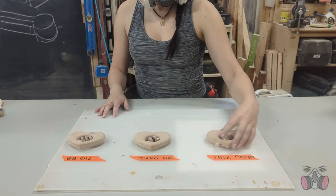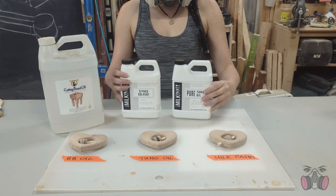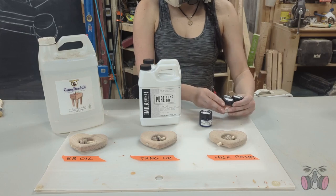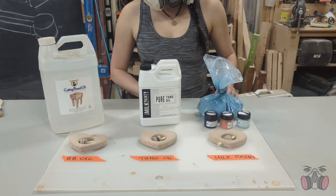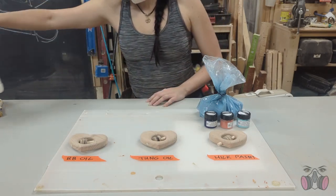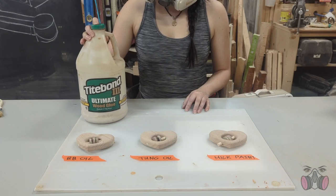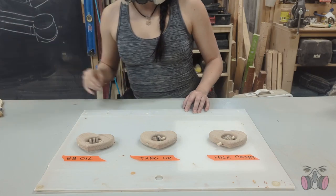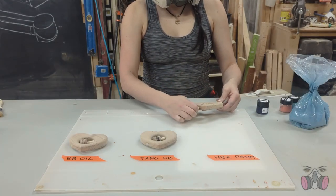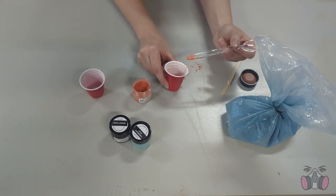Now on to the main part: the finishes. The finishes I'm going to go through are butcher block oil and tung oil, which are two that I'm very familiar with because I've used them before. And then also I'm going to use the Real Milk Paint, which I have never used before — so this is going to be kind of like a review where I try it out. It's technically not a finish because it will most likely need another finish on top of it in order to seal everything in. And I also used Titebond 3 wood glue because this one is waterproof and approved for indirect use around food. As always, I am not sponsored or affiliated — my shopmates and I bought all of these ourselves. So if I paid for something and it sucks, it is my right to say that it sucks.